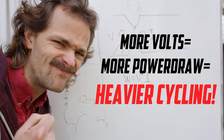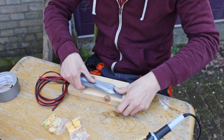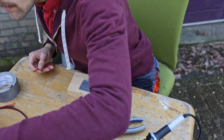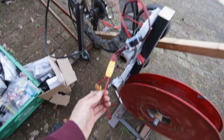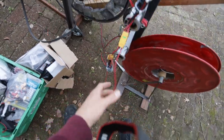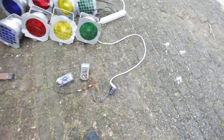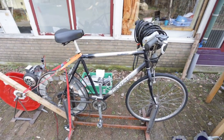Makes sense? Let's build it. I have the series connector here that connects positive-negative to negative-positive as I explained. We have the whole metering setup again and eight lamps in parallel. Let's see if we can power this.